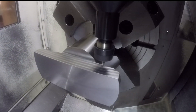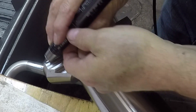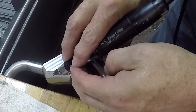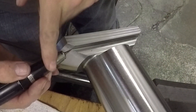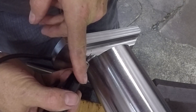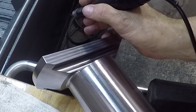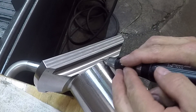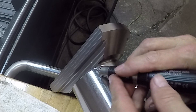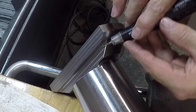I sped this up as well, then back to tool 80 — here's deburring the part with the little NSK pencil grinder to deburr those corners. Using this tool takes a little getting used to because you're sort of climb milling with it, and you've got to use a delicate touch. You can't push it like a conventional cut or it'll dig in too much. You actually want to let it gently ride over the corner, but it can get away from you — it'll tend to grab. So it takes a little bit of practice.